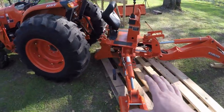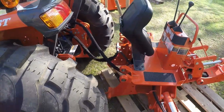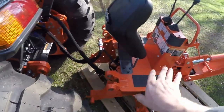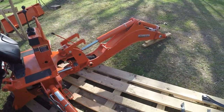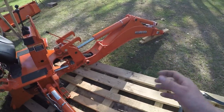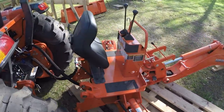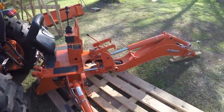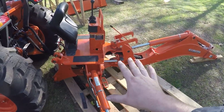I've repositioned the tractor right up next to the backhoe and I've also connected the hydraulic lines. Originally my thoughts were to plumb in all of the circuits for the hydraulic thumb before introducing any fluid into the system, thinking I was going to save some mess that way. But when I swung that boom out by hand, I quickly realized this already has a partial charge of fluid in it. I was expecting to feel some compression of air in those cylinders, but rather it came up against a hard stop until I took a bungee cord and threw that lever back to bypass the fluid through the cylinder. So considering it already has fluid in the system, I wouldn't be saving anything by trying to plumb the thumb in right now.